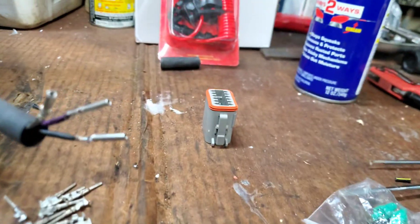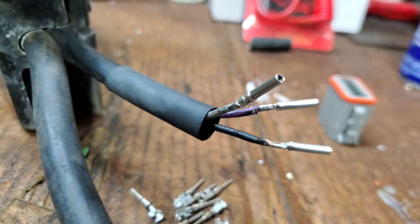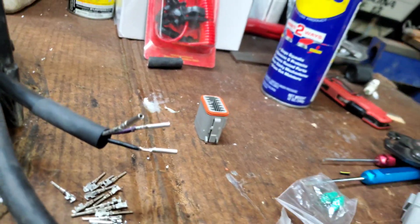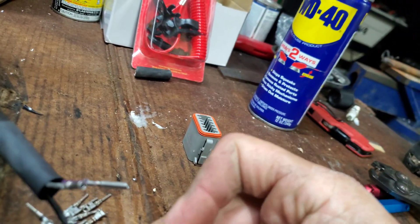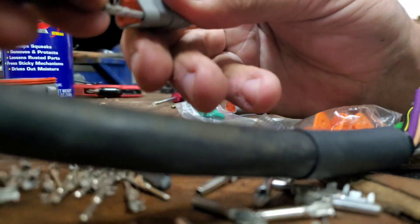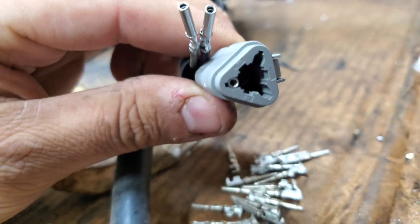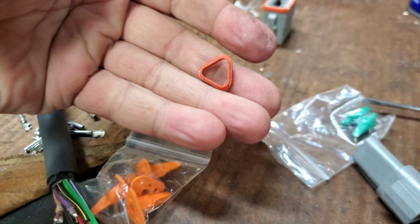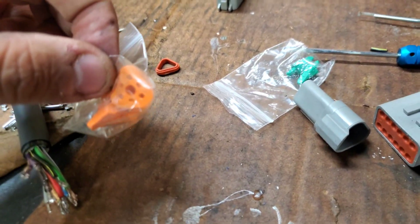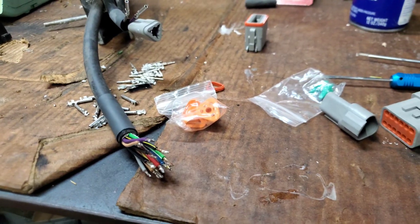We have to cut those all off a little bit to match up because you only need about 3/16 to 1/4 inch of wire sticking out. I'm going to show you one-handed how to put this piece into the connector. You've got to squeeze it in, and when you push it in there it goes to a point and you can see it's all the way to the front. Don't forget your gasket — on the three-prong ones the gasket always wants to fall off, but once you put the orange piece in there it holds it. I'll trim the rest and show you the next step.